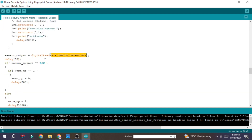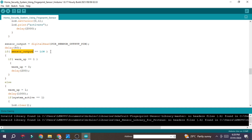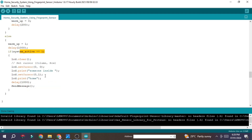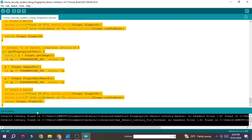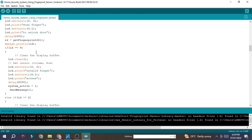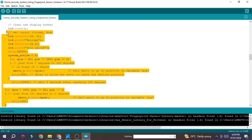The PIR sensor logic reads the PIR input and checks whether the security system is active. If the PIR sensor detects a person and the security system is active, the message 'someone inside home' is sent via the send message function and printed on the LCD. The inbuilt fingerprint sensor library code I haven't explained separately since it comes pre-built with the library. Everything I added custom has been explained. This completes the program and hardware connection explanation.